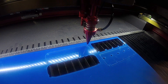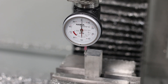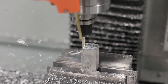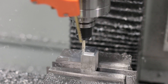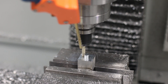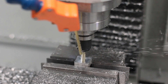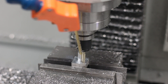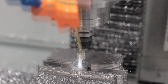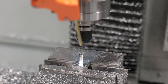The last part I'll be machining today is the badge pin, and I'll be making two of these. They press into the front and the back of the manifold cover, which you're going to 3D print in just a little bit. First up is Tool 31, our quarter inch end mill, using the same recipes as before to rough out the backside of the pin. After a few finishing passes, we switch to Tool 25, our quarter inch chamfer mill, and throw a few edge breaks on it.